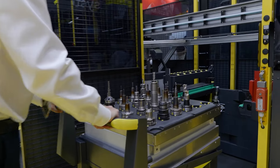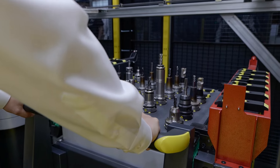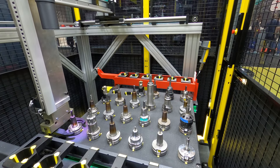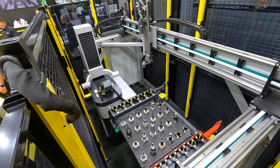Tom, this is, in my opinion, the next step, the next evolution for Zoller in automation. It basically ensures that somebody just needs to push in a tool card into the system and all tools will be completely measured because they have a chip in there. Offsets are transferred to the Zoller C1 database and then the offsets will be right at the machine tool.